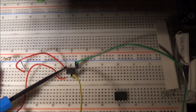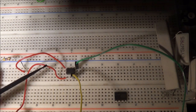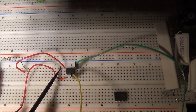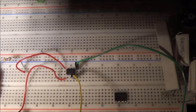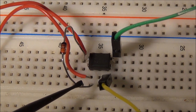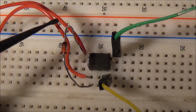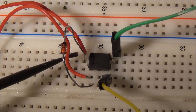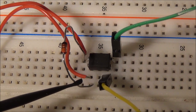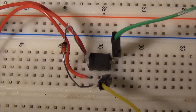This will be the anode here in the IC and the cathode here. When we hook up the protection diode we'll have it the opposite way around - the cathode will be here and the anode will be here. So if we do get things backwards and we have positive voltage in the wrong place, that current will flow through the 1N4148 anode instead and it won't destroy this opto coupler. Now I've got the protective diode in there - the anode of the 1N4148 is hooked up to the cathode of the LED in the opto coupler, and the cathode is hooked up to the anode. So if I feed a positive voltage where it's not supposed to go, the current will just flow through the diode and that'll be that.